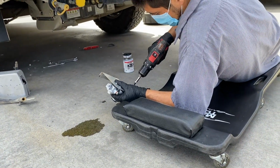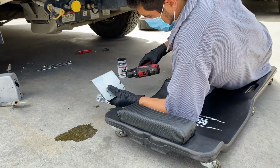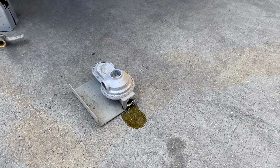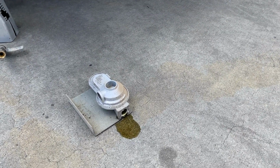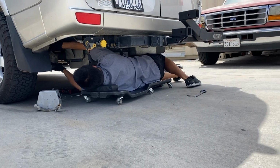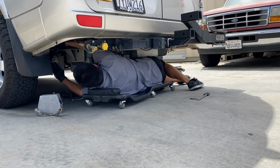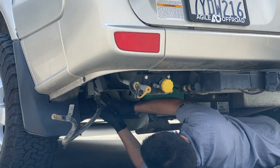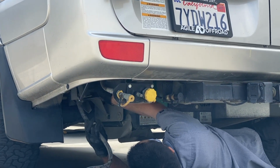He said it's quite common for oil to contaminate the regulator. It comes from the people who are actually filling it. It comes from their tanks. And apparently it's especially a problem in northern climates where it's colder and you have more condensation and that kind of an issue. One viewer said that they were told by a technician to not let your propane get lower than 50% before you refill it. And then I had heard before that not to let it go lower than 20%. So if any of you guys want to weigh in on the debate, please put your comments below because I'd love to see what you have to say.